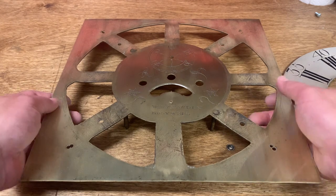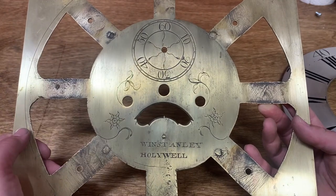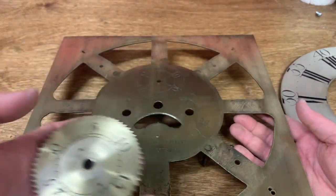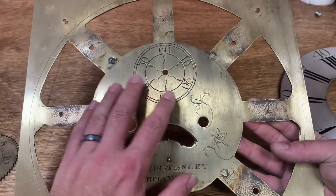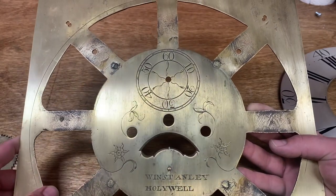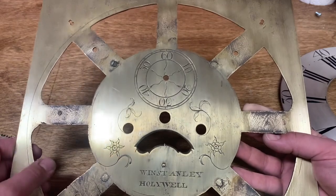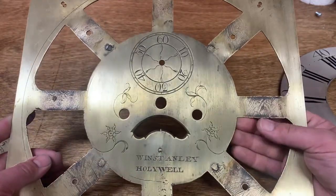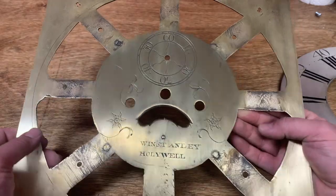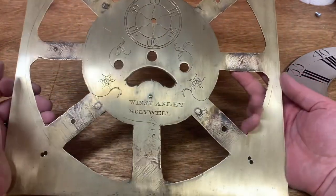Today I want to carry on the process. The center of this clock dial was actually silvered as well, so we're going to work on that. We're also going to work on the calendar wheel, and I think that's going to look real nice. The test as to whether the center of a dial should be silvered is the texture — this is a fairly flat finish. The other clock I showed in the prior silvering series had a dappled backdrop, which would indicate it was supposed to be brass. But in this clock, I have it on good authority that the center of this dial would have been silvered with the same engraving being black, and the outside of the dial would have been brass colored. I have already removed the spandrels — those have been cleaned up and we'll attach those at the end of the video.